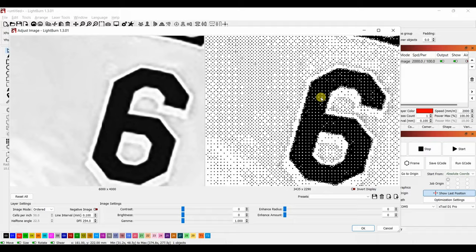Once you have the image ready, focus the laser on top of the painted granite and engrave it at the speed and power you found. For the Messi and Ronaldo engraving, I used 2100 mm per minute and 100% power. For the LeBron James image, I used 7500 mm per minute speed and 30% power. And for the name plate, I used 100% power and 1800 mm per minute speed. For name plate kind of designs, you can also paint-fill the engraving and wipe the excess off, or use a knife to scratch the engraving and make it more white. After the engraving is done, clean the burnt and excess paint using lacquer thinner or turpentine oil and you'll have beautifully engraved granite.